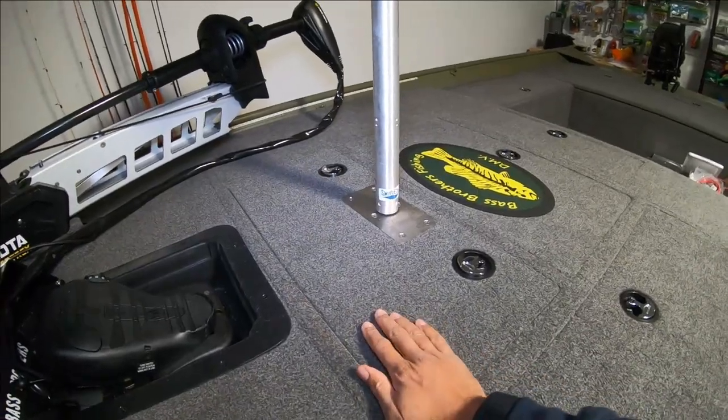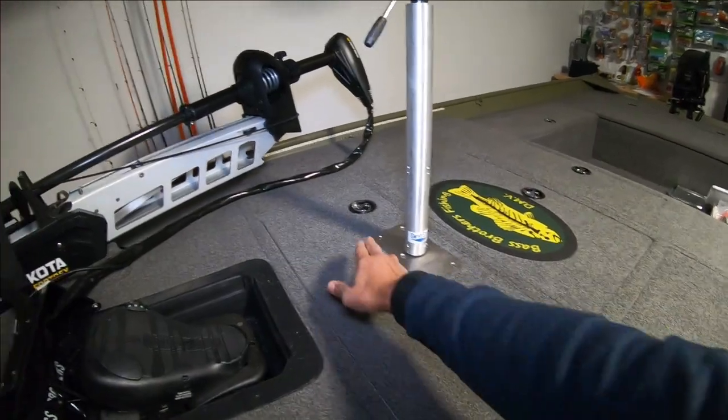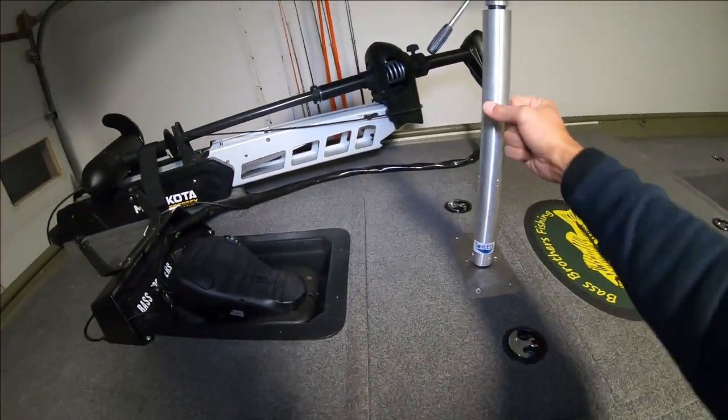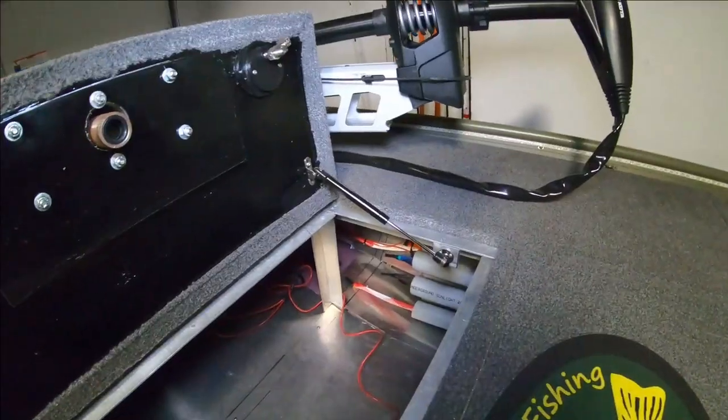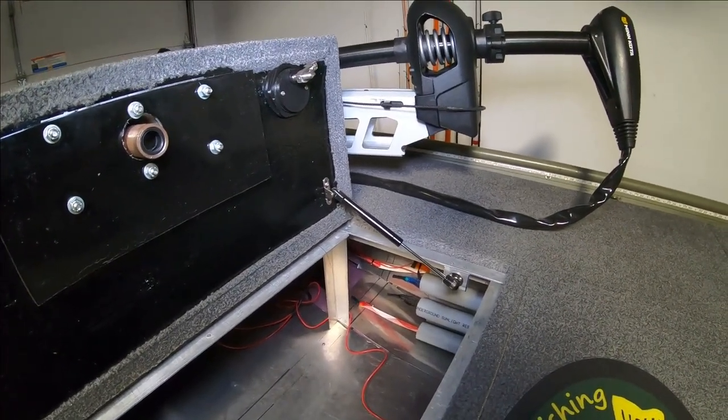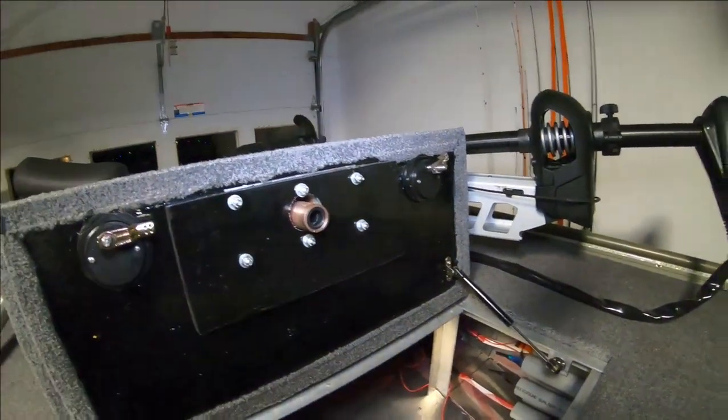It's been about seven months since this installation and I haven't fallen out the boat yet — the pedestal seat install is holding up perfectly. I did install two latches, one on each side, to give it extra stability on the hatch lid so there's no rocking as I'm using it. Surprisingly, the strut is just a single 10-pound strut — I thought I'd need to upgrade to a stronger one because of the added weight, but it turned out fine. Everything is linked in the description below.